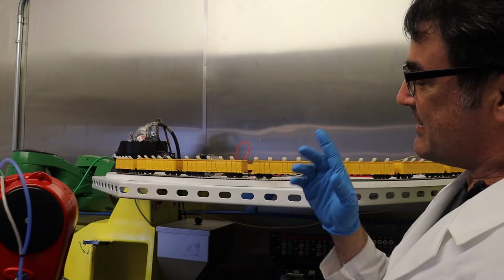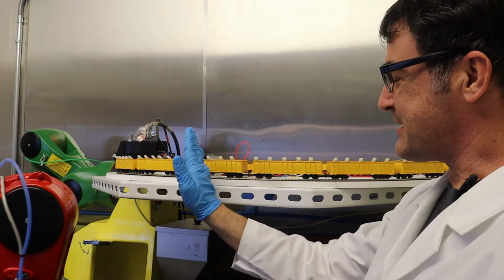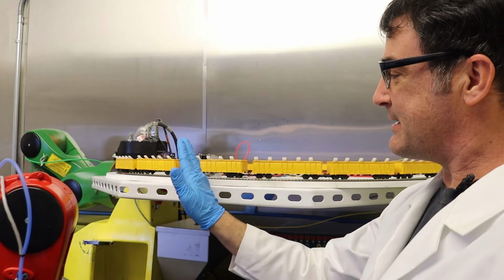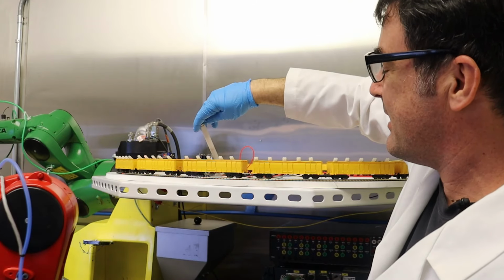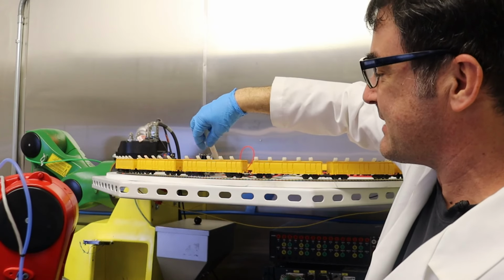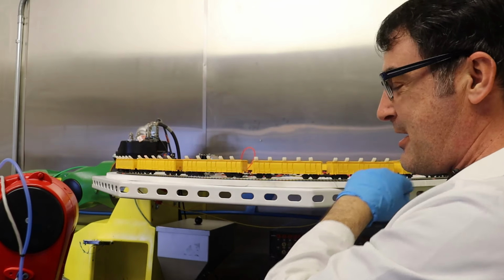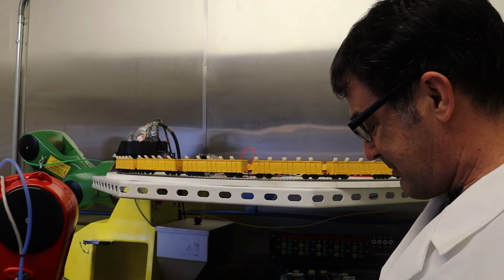So because of that, when the sensor sees that the train car is in the right spot and the little train locomotive shuts off, the cars keep drifting and then they're out of place. So the robot, using the sensors and the H-bridge circuit, which switches direction, does a kind of fine tuning operation. And then finally we have this train stop, this bar on a DC motor. I can show you in a second. It slowly drops down between two cars and locks the car position into place. So let's try it out. And then I've written a loop in the red robot to basically unload all of these cars. And for this experimental program, it's just gonna pull the part and then drop it into a bucket on the floor.